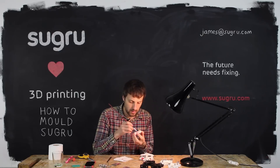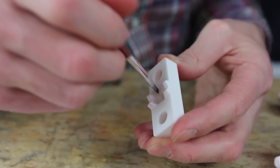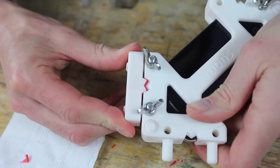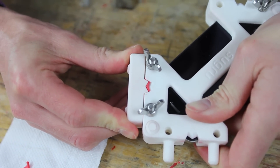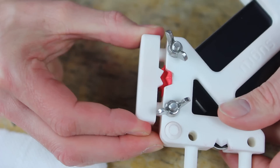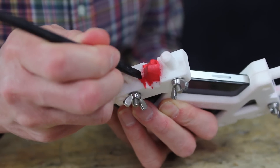Apply a fresh coating of washing up liquid to the third part of the mold, and then compression number two. You'll be able to push this closer to the mold — basically we're trying to get it so we can close the mold. But every time we compress we're generating flash, so it's about gradually removing all the flash.